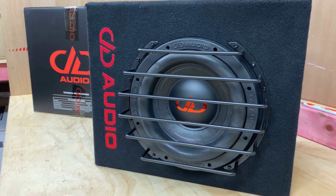I've built enclosures in the past, and this here I would very happily just lift into the back of my car, put an amplifier onto it, and away I go. It's a really tidy unit, and you're knocking on the door of 25kg — it's a lot of subwoofer. It's an amazing sounding woofer. D2 in here, 35Hz is where it's tuned to, and it really is a fantastic sounding sub in a box.